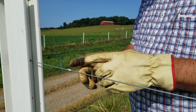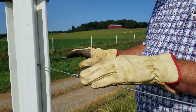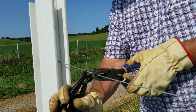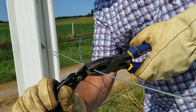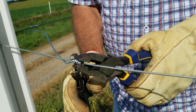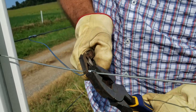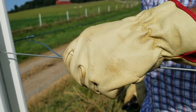If you're going to use twelve and a half gauge wire to jump your wire and get the energy to flow from one section of fence to the other, what you need to do is come back with a pair of pliers and do some extra tightening. Go in opposite directions and tighten in two different directions so that you can get a really good fit. If you do it correctly, you shouldn't be able to slide this wire back and forth.